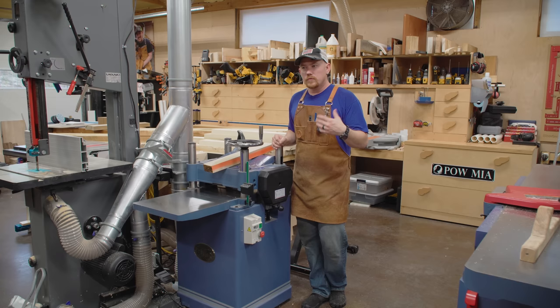If I had something much larger — say a single glue-up for a workbench top — I obviously can't fit it through here, and if I could it would be a struggle. For me, this isn't the tool to do it anyway; I'd just put it on my CNC machine and flatten it. If you're doing a lot of 18 by 30-inch cutting boards or slabs that wide, then your workflow will justify a larger machine. But for 99% of all the furniture I've ever made, a 15-inch planer is just fine.